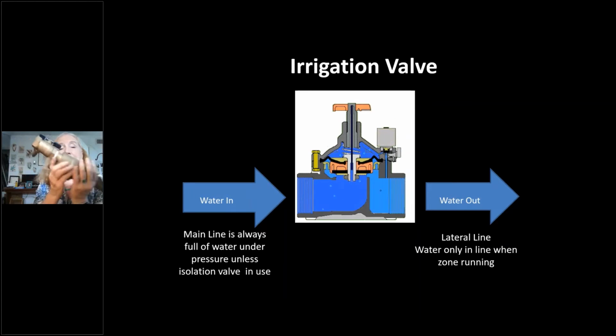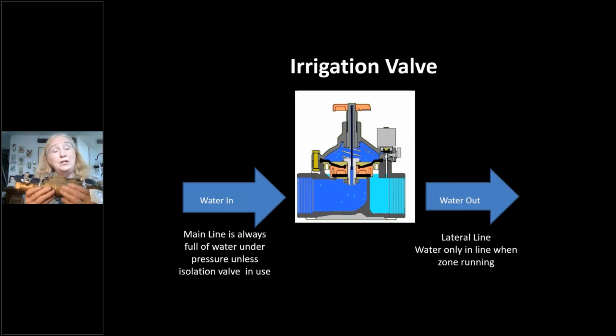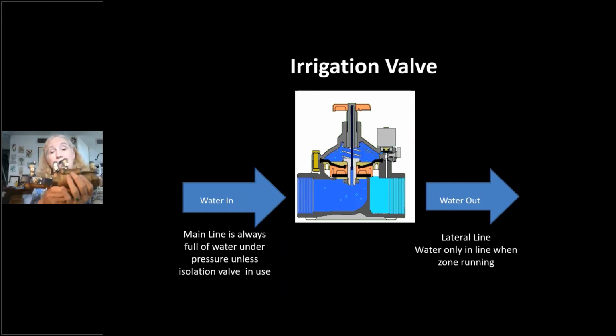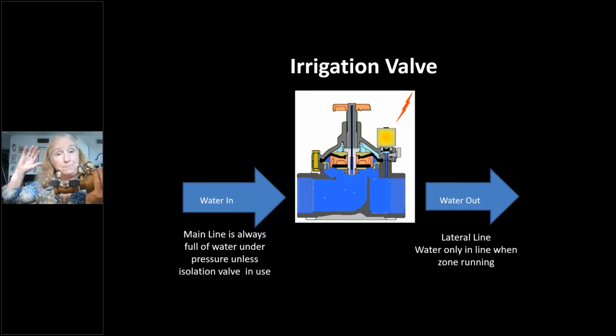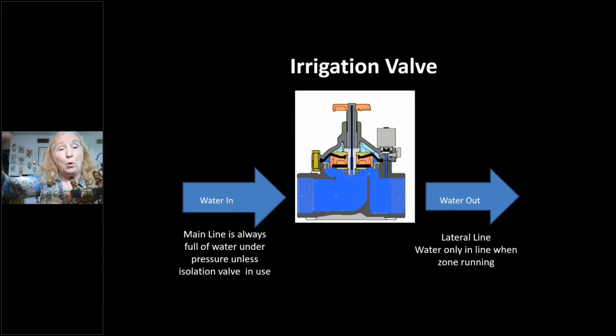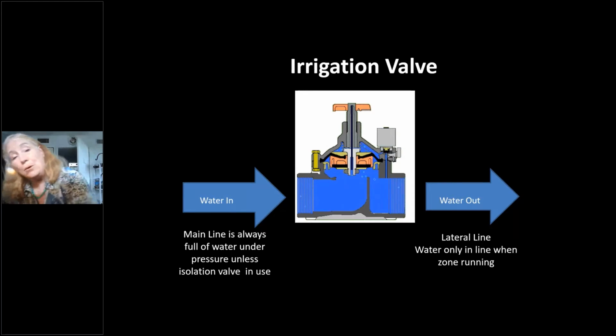The other thing that's going to be keyed off the line that does your sprinkler system is this component. This is called a backflow prevention device. A backflow prevention device is all about protecting you and protecting city water. What we don't want to happen is a pipe breaks in your house and puts a lot of back pressure, and the water from your sprinkler system main line is sucked into your household water. Or, heaven forbid, there's a fire somewhere and the pressure backflows into the city water system because of the huge pressure that is needed. So this protects you and your city water system. It's very important to understand that it needs to be checked to make sure it works properly.